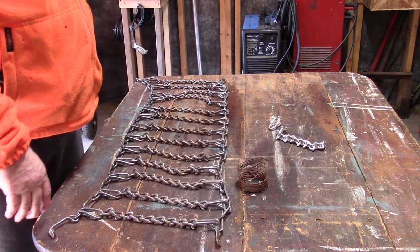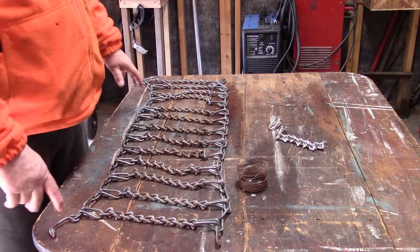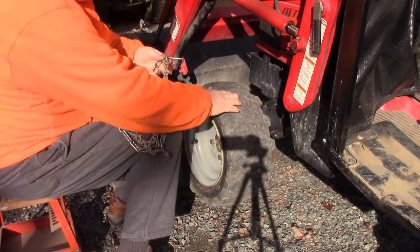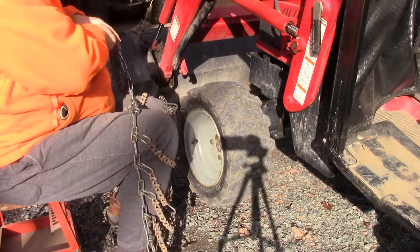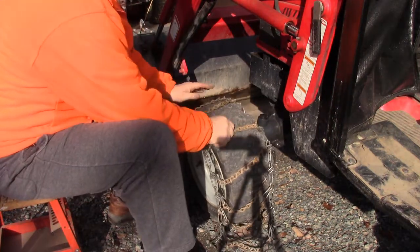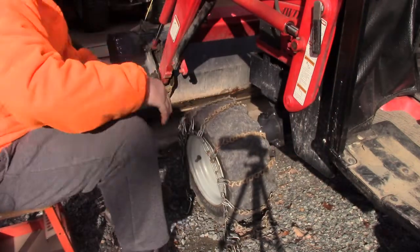Having said all that, I've got the tractor out to the door and the front wheels lifted up — I just lift them up with the bucket. So we're going to take this chain out, set it on the wheel, and we'll start to wire up. We want our picks to be on the outside edge of the tire, and we want our quick-connect or flexible link on the outside edge of the tire. So we have to turn the chain around 180 degrees and set that on the wheel — there's our ice picks facing up and our flexible link at the bottom. And the squeezable link at the back.